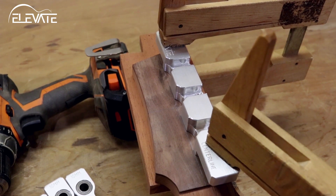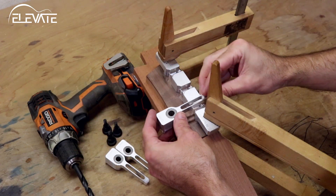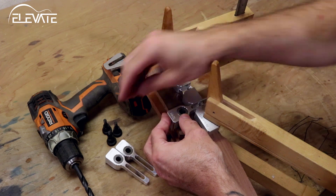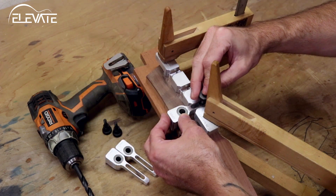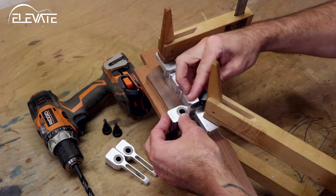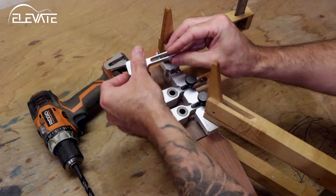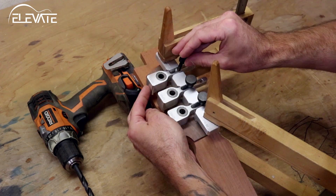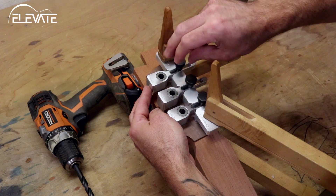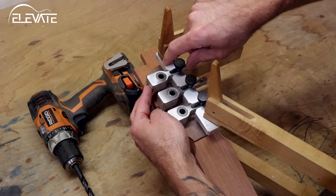For the purposes of this tutorial, we're going to look at two common scenarios for tuner holes. The first is a straight through 10mm hole. With the jig body clamped in place, insert the 10mm drill guide fingers. Each finger has a hard stop on the bottom that places the tuner hole one half inch on center from the edge. Slide the finger until this stop contacts the edge of your headstock and lock it down tight. Once all fingers are secured, you're ready to drill.